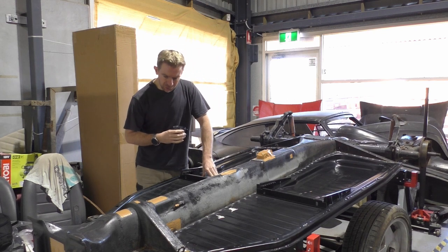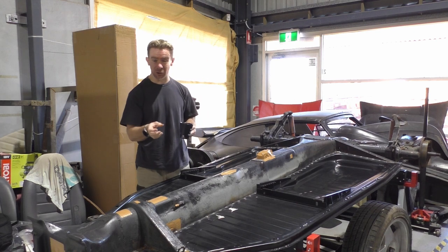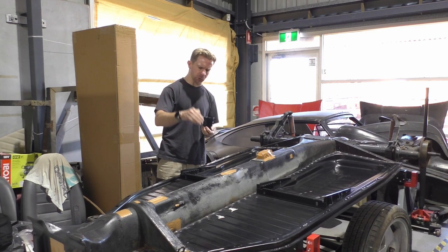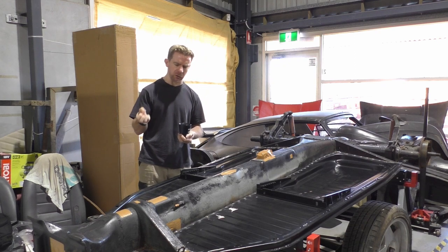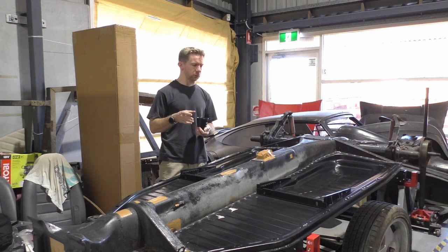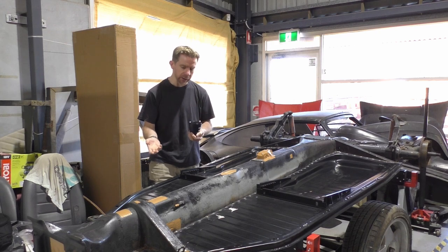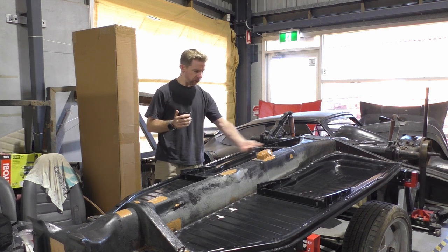But what I'm considering doing, though, is because I did lay these out rather spaced, like I think it's about a little over an inch every time, I may drill extra holes throughout. So maybe every second or third gap I might actually drill through, penetrate into the actual chassis itself otherwise, and lay a couple more welds along there, just so I do know for certain that there is more grab going on. What I'm going to do, and unfortunately I won't be able to get to it straight away, is flip the pan, get a small rubber mallet, and then go along and just see if the welds break, because if they break with a rubber mallet, you can well imagine what's going to happen when I actually go to put this thing on the road. A little bit of flex and yeah, seamed away.